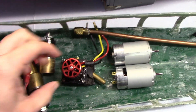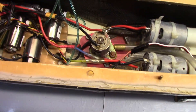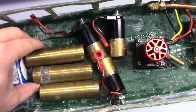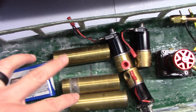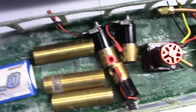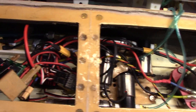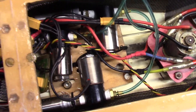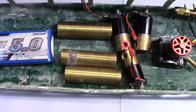After that, I'll plan for a pump — this isn't the pump I'll use, this is a battleship pump, but generally the pumps are about the same size. I'll plan for the pump to go just forward of the motors, and then plan for solenoids. In this case I have some loose solenoids that are generally the same size, and I plan to use expansion tanks about this size. I'll probably end up just taking the exact guts from the Lutzow and dropping them in to confirm they fit. If I didn't have a reference boat, I'd be doing it more in this random component style.